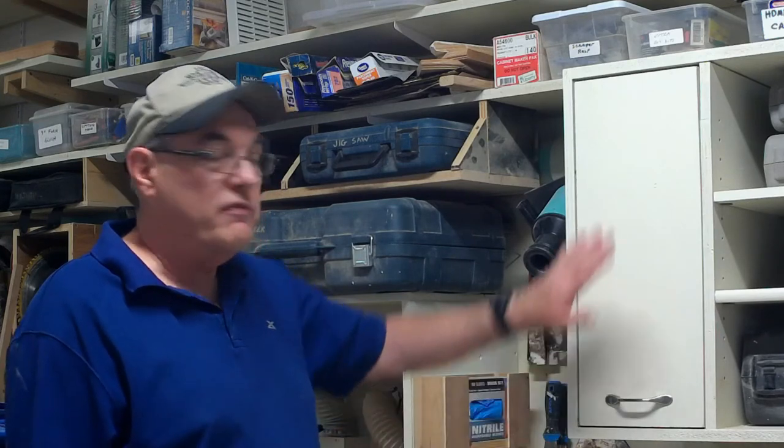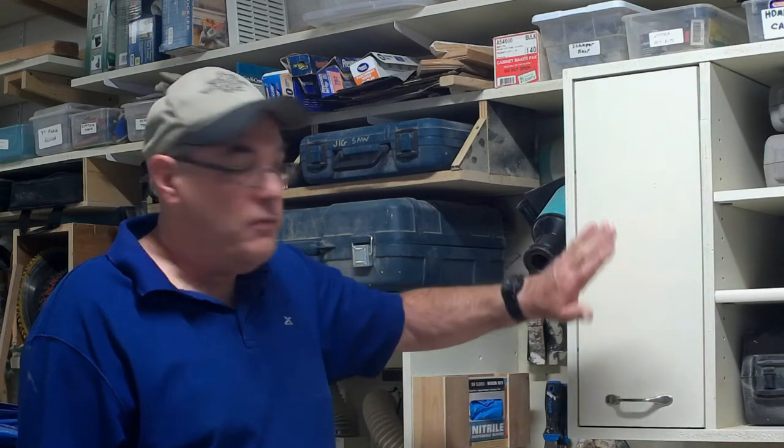This is a shop cabinet with a fully inset door — meaning the front surface of the door is flush with the front surface of the cabinet, with no overlap of any kind. You could use the same jig we used earlier in this video to fit this door; you would just need to modify it. The same procedures would apply and it would have the same success rate. However, I would like to show you an alternative method that has the virtue of being quick. We would just cut some shims and use some double-sided tape to make that happen. However, the downside to this method is that once the door contacts the tape on the front of the drawer, it is there — there is no adjustability. So if you need to reposition it, you will have to pry it off the front of the cabinet and start over again.